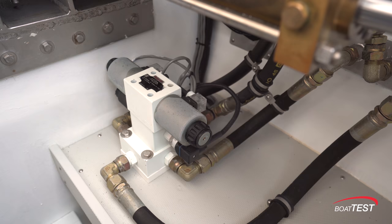For example, at 8 knots the range was 2,922.1 nautical miles. At 7.5 knots it was just over 3,487 nautical miles. And at 7 knots we could keep going for just over 3,975 nautical miles. So again, small changes make big differences. Be sure to look for the full half-knot increment chart in the written reports section on the BoatTest.com model page for this yacht.